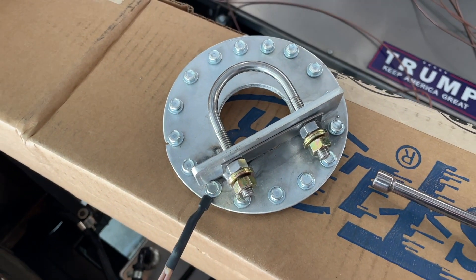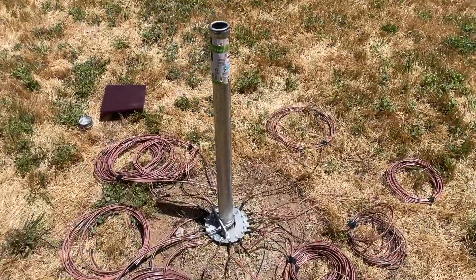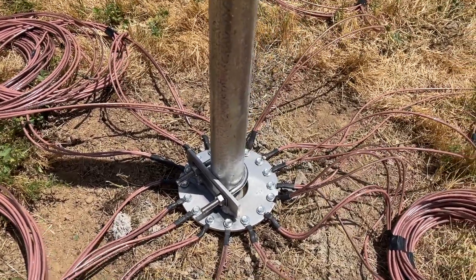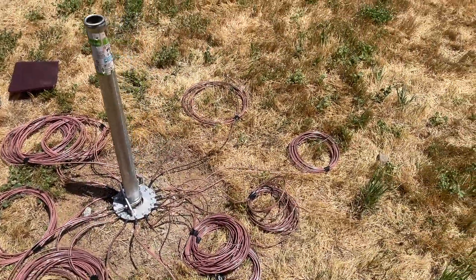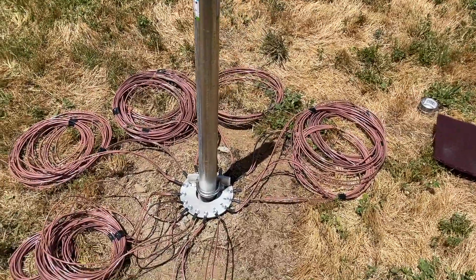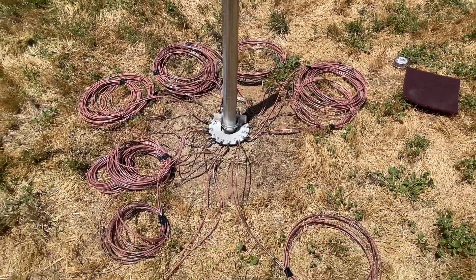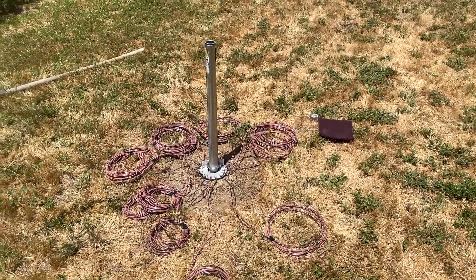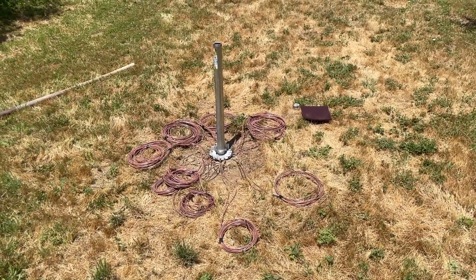This is where it's at. I've got my aluminum grounding plate for the radials on there with a stainless steel U-bolt. All my radials are almost paired up in twos, marked on my plate. The eight-foot ones are there because of that plant, and I've got a couple of 12s with the rest all being 14s. If they're a little long I can always trim them. I cleaned up the pole with scotch-brite, so now I just gotta string them out and push the little holder-downers in.